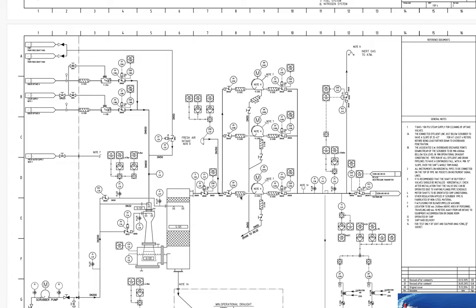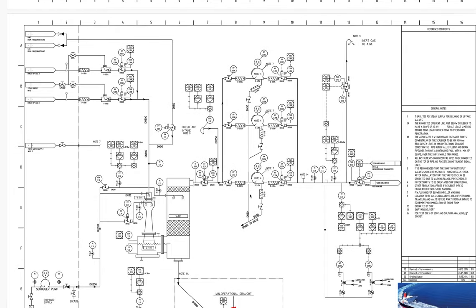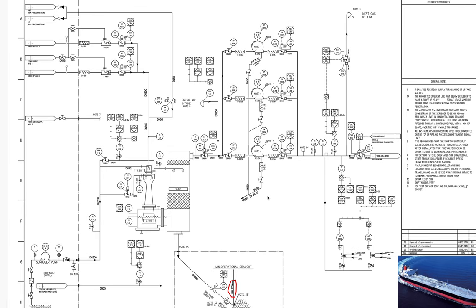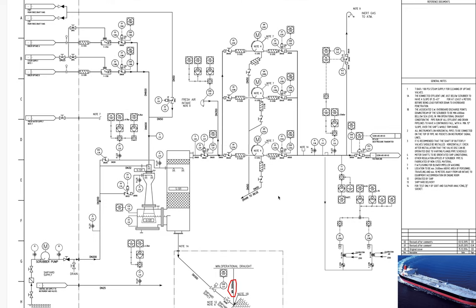Another thing: there are some transparent tubes — you must keep spares on board because they are affected by heat and must be replaced. On the last vessel, we did not have these tubes. You can also use a metal or copper tube, but you need to ensure you have the same size. Here we also have a fresh water supply at seven bars for cleaning of the blowers.